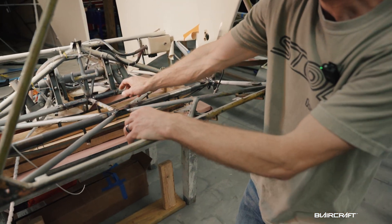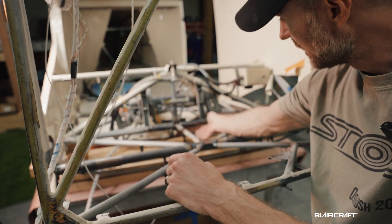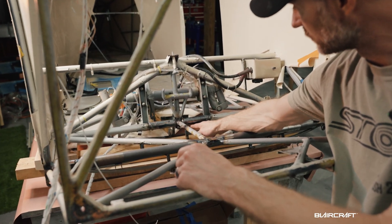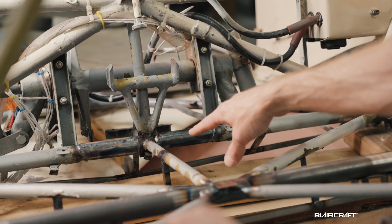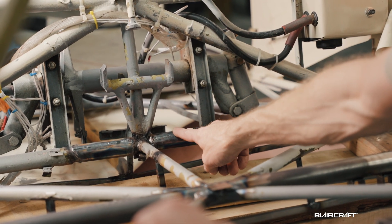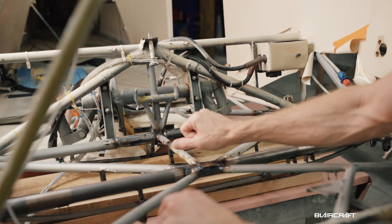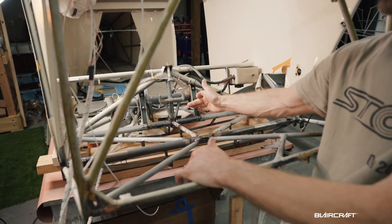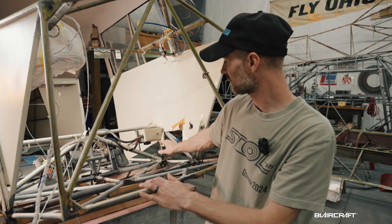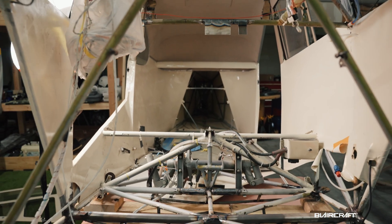Back here, there was actually a crack. When I took off the rubber strip, underneath where the stock gear would bang against the tube, there was a metal plate that was bowed in and had cracks underneath. The other side was almost like someone had crinkled it in — cracked three-quarters of the way around. So in the process of repairing and rebuilding this to make it stronger, we fixed the gear issue and then found those additional issues. Now those are a hundred percent built up and secure.